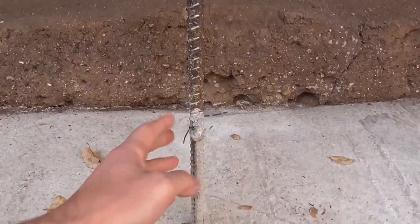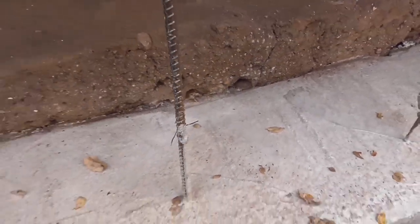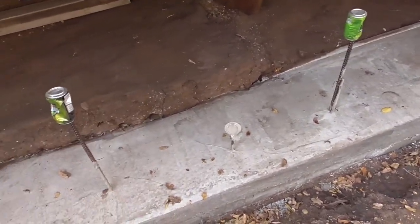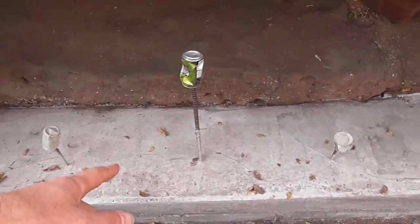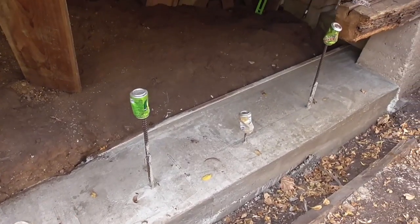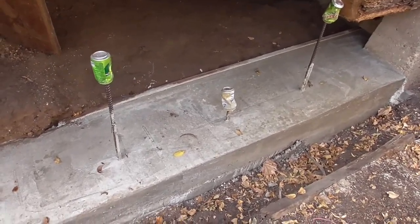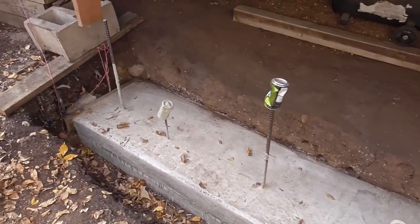Here's another 5/8" I put in. The other guy had almost quarter inch. They were actually placed two feet apart, so it probably would have been fine. But I did some reading in my book and they only need to be 4 feet apart, so I went every other. The whole footing wall is about 6 inches taller, so we're going in the right direction.